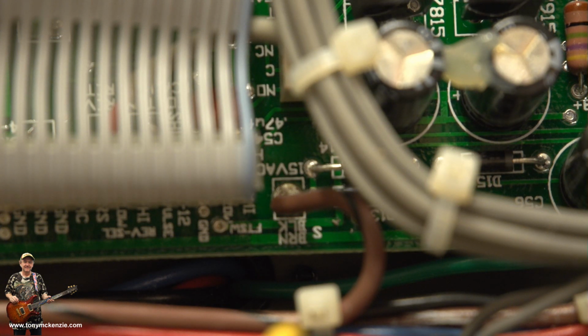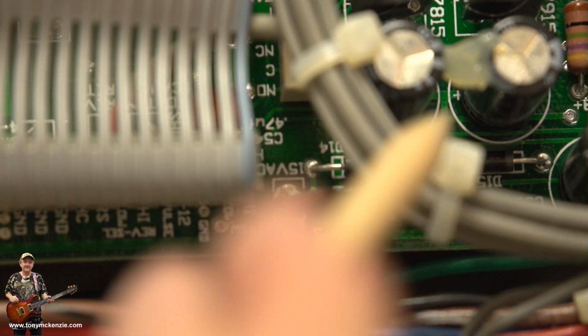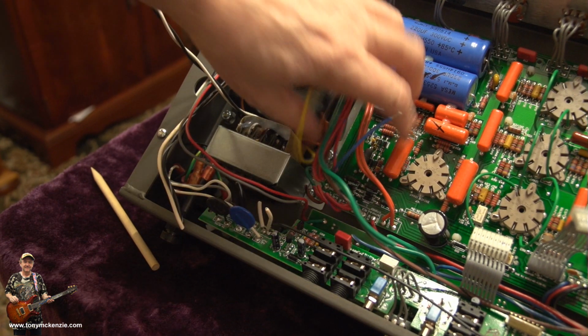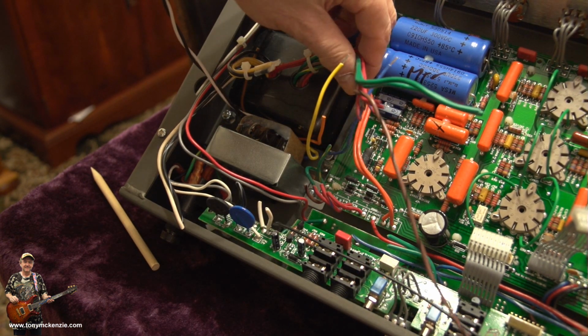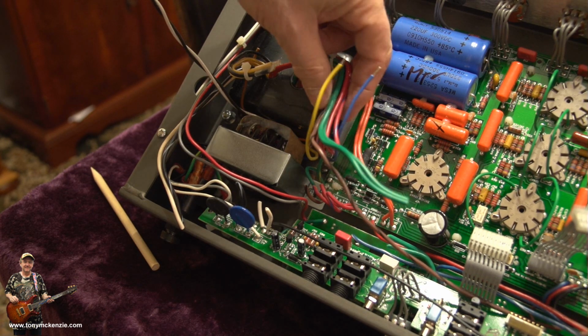It can be confusing. What it actually is, is a 12 volt out of the power, and it's 12 volts AC, and so it goes off to the couple of places where it should do. One goes down to ground and the other goes through these diodes down here. You probably can't see them too well, but there's some diodes down there. Oh, it all looks scary. I've cut all the wires. I've left the originals in place so we can track them back if we need to. And you could even join them and put the thing back as it was.